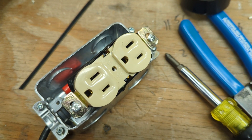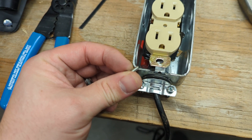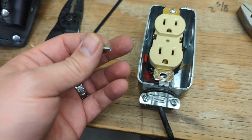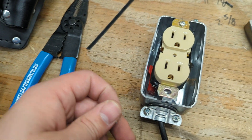We're going to screw this down in the box and put the face on. You need to take your lineman's and snip the mounting screw down because it will run into the NM connector since you're using the top and bottom. In your case, just the bottom, because you don't need the top — that's for future use with this little project.